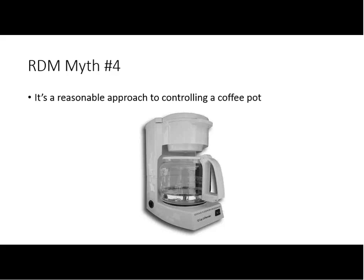It is not a control mechanism. And even though somebody could do something and could effect control with it, and some would say, oh, but it's got a checksum in there, so it's all good. Well, yes and no. Yes, there's a checksum in there, but by safety standards it's considered a very weak checksum. It would not be adequate for a life safety application. And the fact of the matter is RDM is not designed for life safety applications. If you're doing anything that involves life safety, there's a whole lot more you've got to consider and design around than what has been done in these protocols.